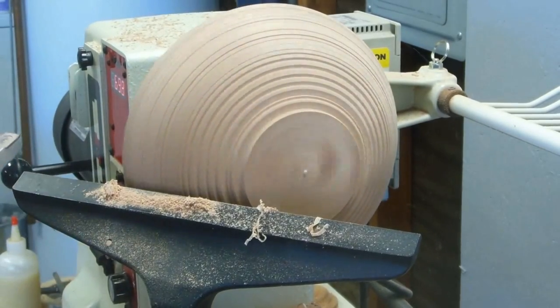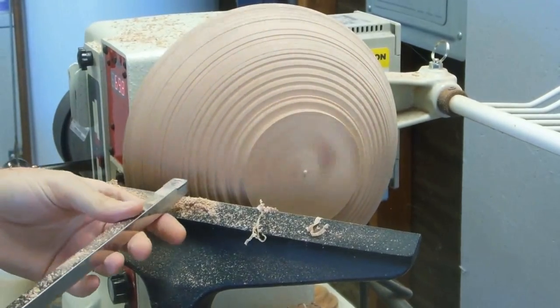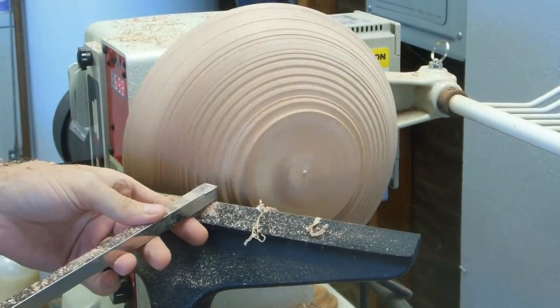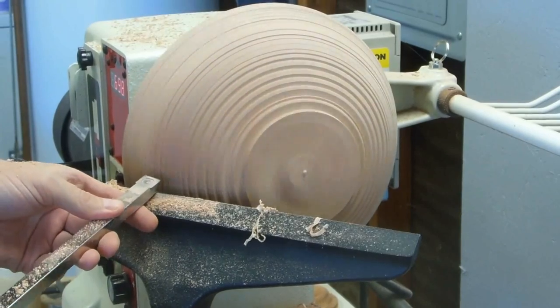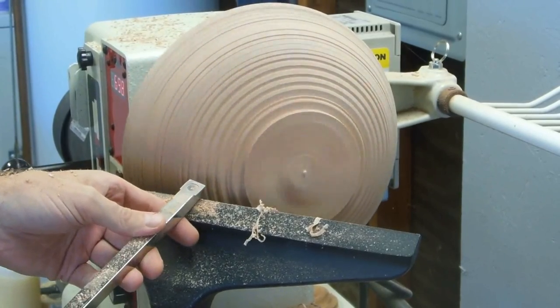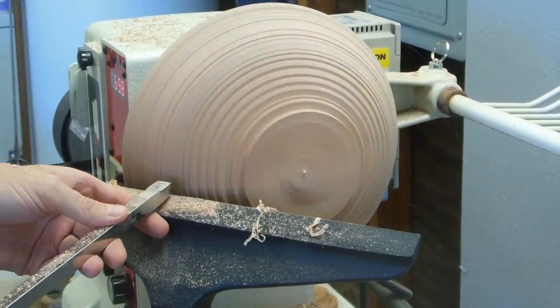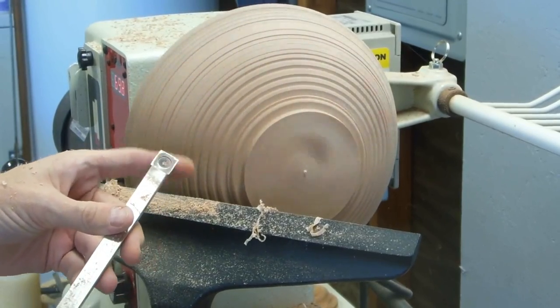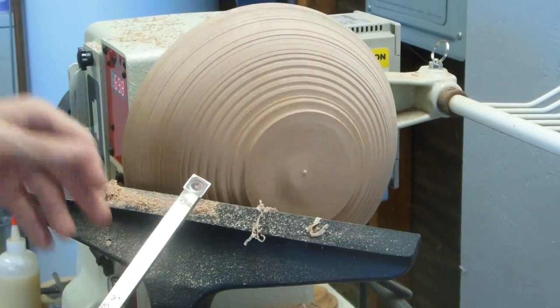Remember that turning a bowl with carbide tools is actually pretty different than using a bowl gouge. You get an effect when you do the roughing out, and you smooth that out, but you can still use the square carbide cutter for that. In fact, that's the best tool for setting the shape of the outside of the bowl, especially if your square cutter is slightly radiused like mine is. Be careful, the end of the tool gets really hot.